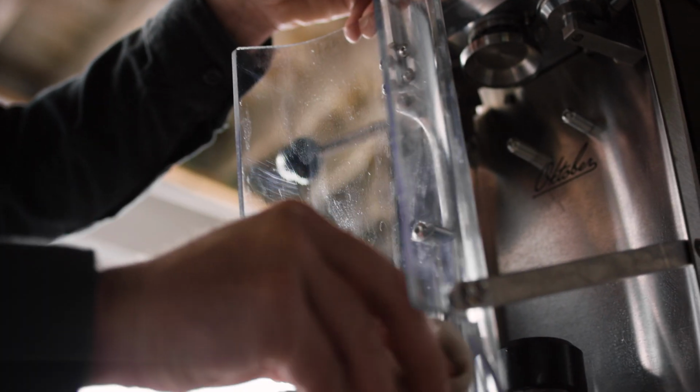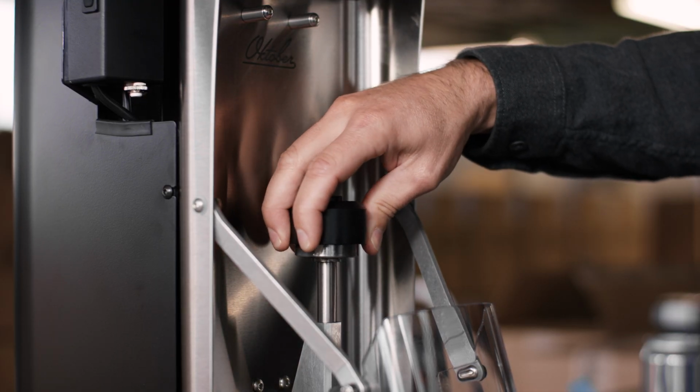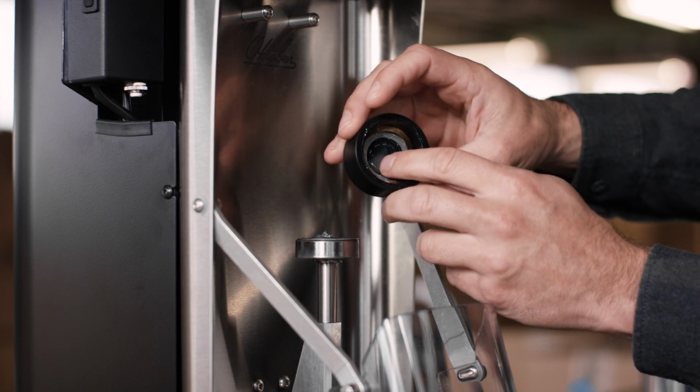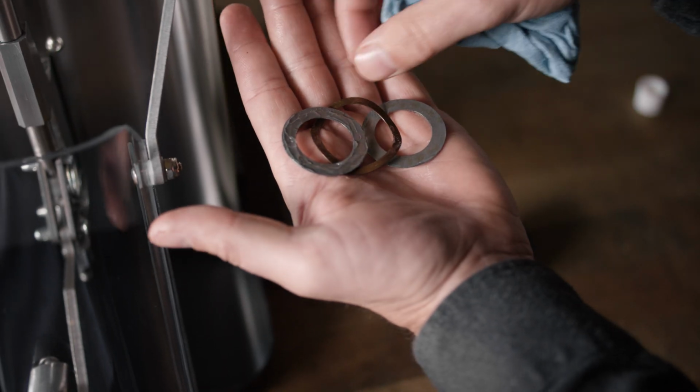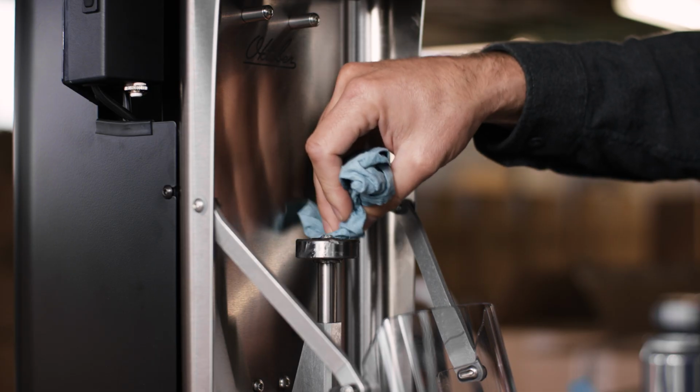Once a week or so, pull the lower adapter off the bearing and wipe down the bearing and spring washer. Dry them off and add a dab of grease.